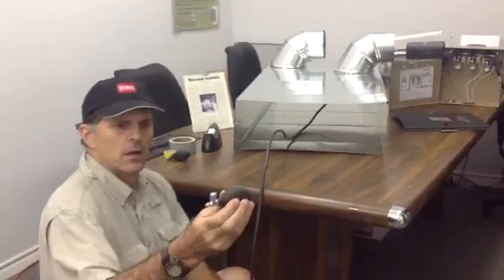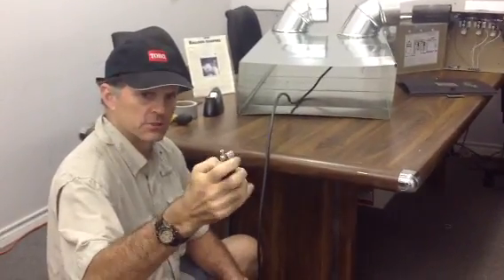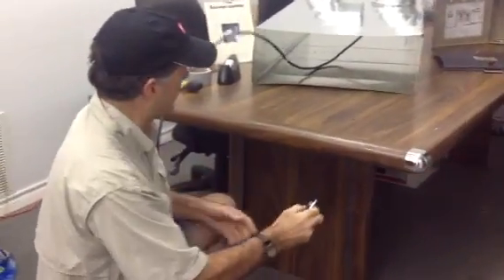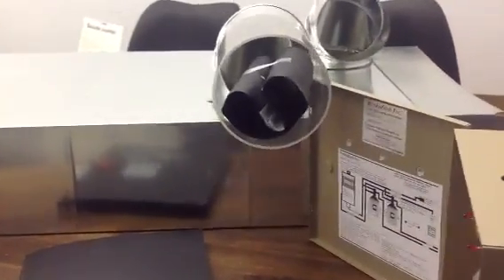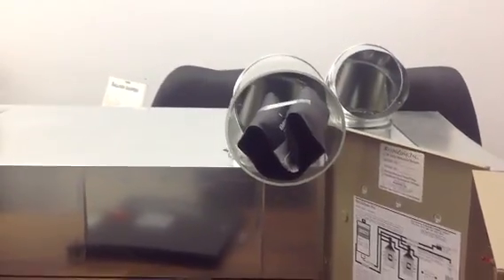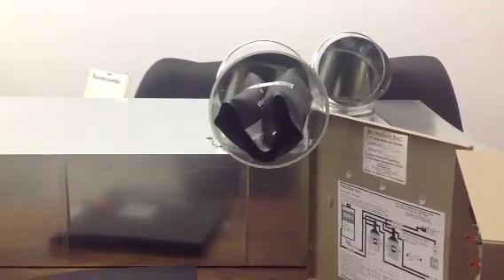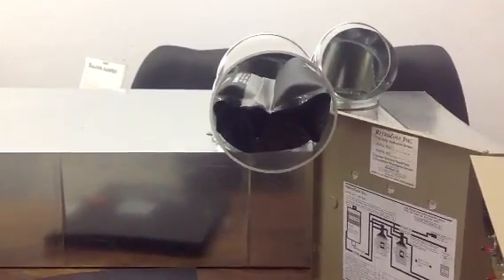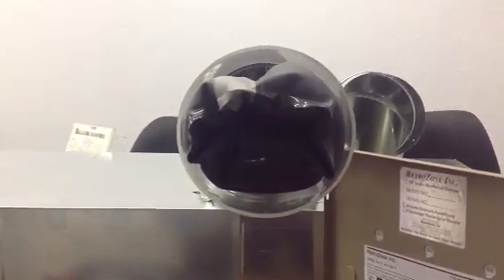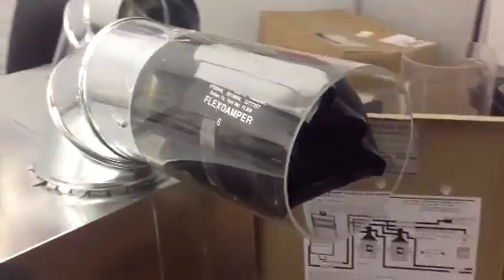This is a standard hand pump for a blood pressure cuff. You've seen these in the doctor's office — we're going to add these to our parts line, because this is a valuable device. While you're on the ladder, we're going to deploy the damper in the duct. I want to get that yellow tape right where I want it so I know where that damper is, because it's easiest to move right now. I'm going to pump this, and we're going to be rewarded by a nice sharp pop when that tape lets go and the damper deploys. There we go. I'll give it a few more pumps just to show what it looks like. We don't want to overdo it — that is deployed, and even if it weren't, it would deploy with actual use.